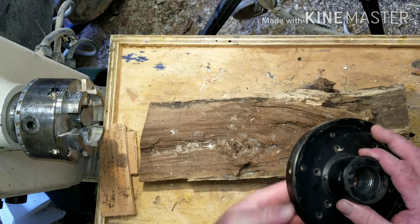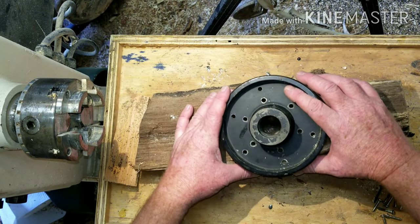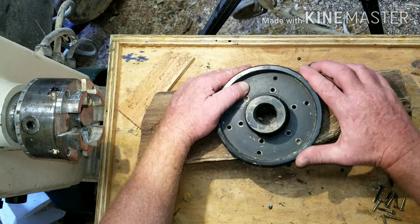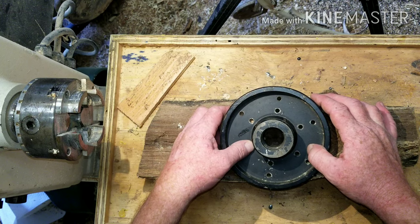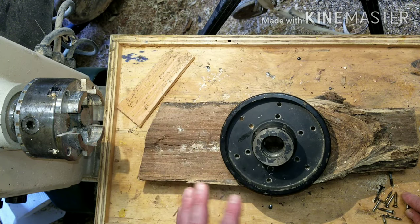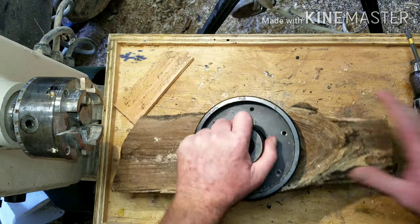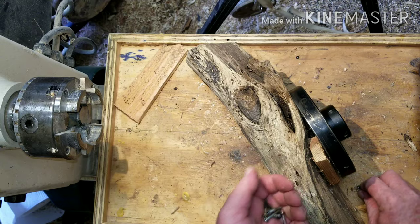So what I'm going to do is I'll take this off here like that and put this here. I just don't know what it's going to do. It'll be an adventure to see how it goes. I'm going to put this here like this. Oh, that piece is too chunky. I got this piece here. I'll put it right there. It's a 16-inch log, so eight inches will be the center about right there. I'm going to put some screws in it, probably just in the middle holes because I don't know what it's going to do yet. Five screws. Don't do what I do people - this isn't safe, but it's what I'm going to do. So let's get these screws in and put this on the lathe and see what it does.